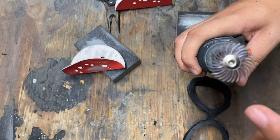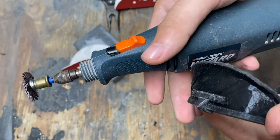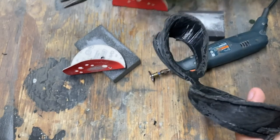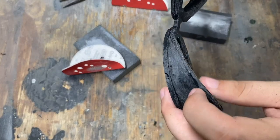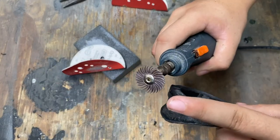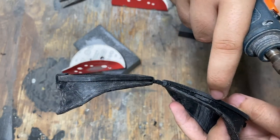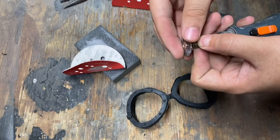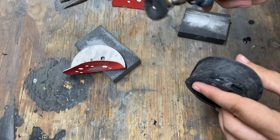This is actually my first time ever using this type of sanding bit — it works really well. You can see how smooth that part is getting, and you can see my layer lines aren't really that good, it makes it a lot easier to get rid of them. There's some leftover support hanging down right here and this works very well with that. I should have made the shell thickness thicker — you can see I have to fill in these little holes, but that's easy to do with some Bondo. This tool works very well, especially in these tiny little crevices and little trenches — this little bit fits right in there perfectly. The other bit I frequently use for this type of stuff is this bit — I have no idea what any of these bits are called, but using this one after the previous bit really smooths it all out.